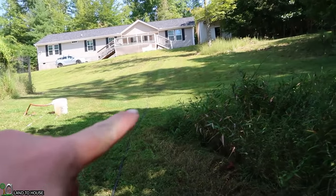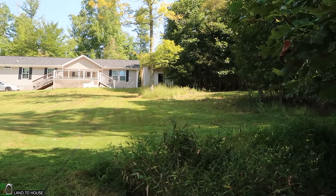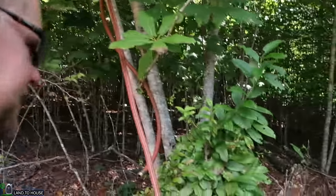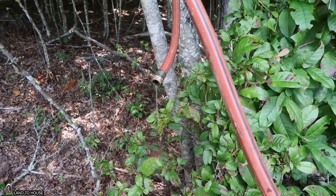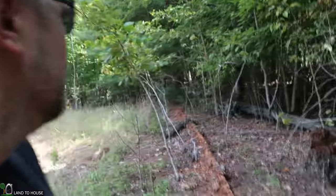What we want to do is walk the hose up and see at the point where the water stops flowing. If it continues to flow all the way out the very top, I've got another 50 feet or so of hose and we can hopefully find an even higher position. The ram pump is way down the hill over there next to the road, and I'm guessing this is somewhere around 35 to 40 feet of lift. I don't think the pump can make it all the way to the top — but it just made it out. So I guess that means we need to lift a little bit higher, because that right there is still a decent flow rate up here at the top. I'm almost out of hill, to be honest.